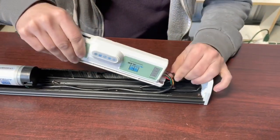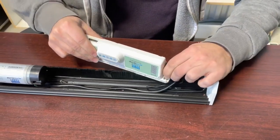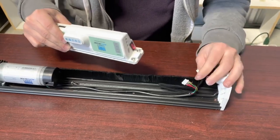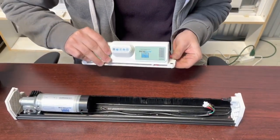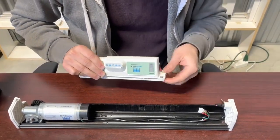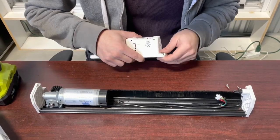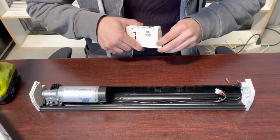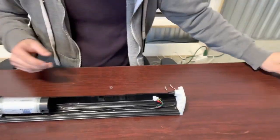You're going to take out the old board and unplug the cables off to the side. Depending on which model you have, you'll have either two or three cables. Take the old board and put it aside after you've removed the screws.